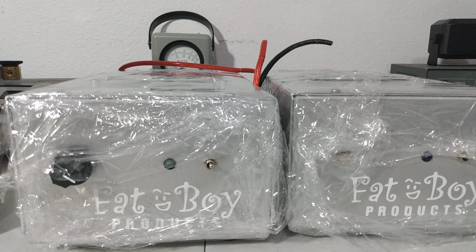To me, that is a low drive amplifier. I think they use the term HD or high drive as a sales gimmick because it sounded more badass when they were selling it. Like, oh, you've got the Palomar 250, I've got the Palomar 250 HD. No, they're the same amp. Not any difference in them. They both do 200 watts, 250 watts PEP. They both take a 35 watt radio swing, and they both take 2 watts of dead key.